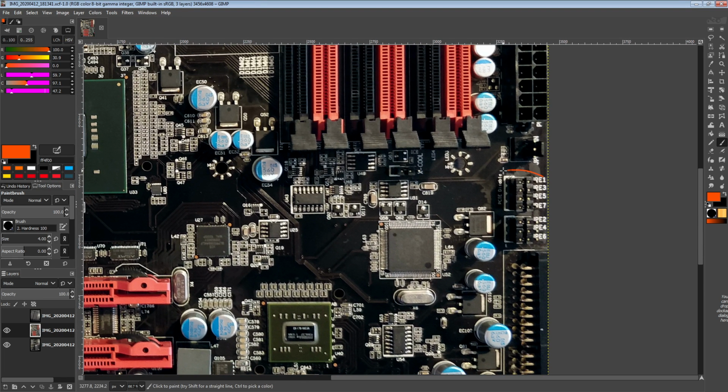Then up here we've got more PCIe enable disable jumpers. These are just for troubleshooting any PCIe device, but primarily the idea is if you've got a big multi GPU setup with the GPUs on water cooling or something, then it's a real pain to remove a GPU that doesn't work. So you can just pull a jumper and test which GPU is causing the post issues or whatever. I also use that on air cooling because I'm just that lazy.